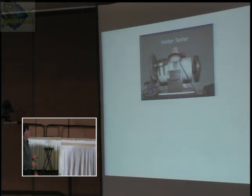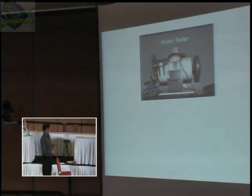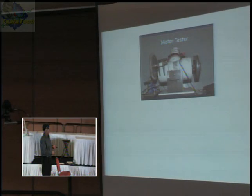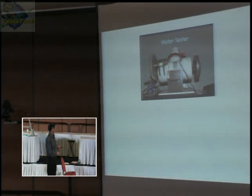And that way I could determine, oh, these coils, by the way, have an air core in them. And I was putting soft iron in them to test the effect of an iron core. And this was a Bedini idea. I was beginning to use diodes and collect the back EMF from the coils.